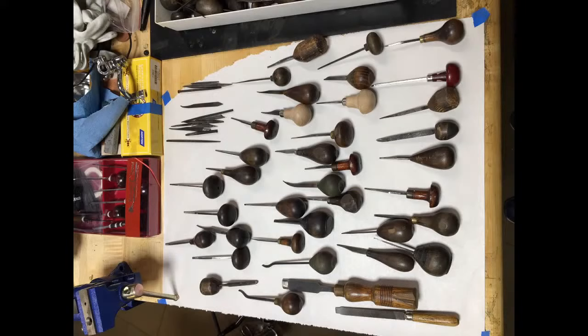Here are some tools laid out — you can see all the different shapes: liners, straights, and shaders. This next example is a re-engraving of a Conn 10M tenor. The left shows before — worn and re-lacquered over the years, engraving slightly worn away. On the right, after re-engraving using tools very similar to the originals. That center figure, which people call the Conn naked lady or lady face, is done with straight cut — not wriggling back and forth, just hand pushing.